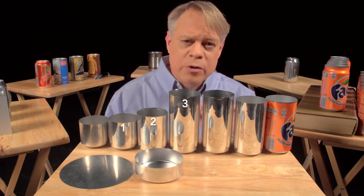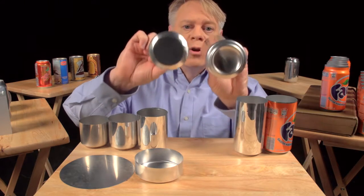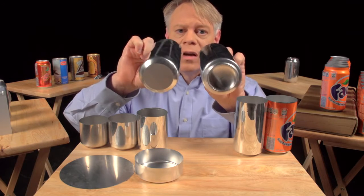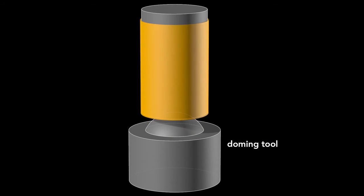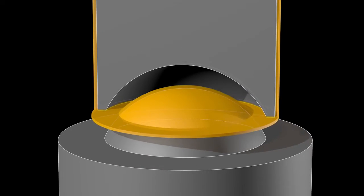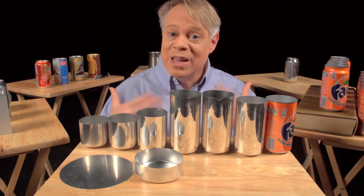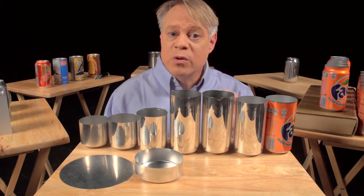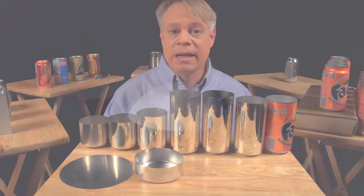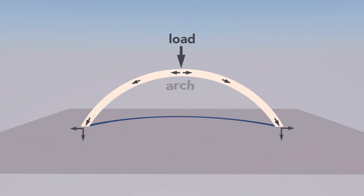If we watch this process up close, you see the initial thick wall, and then the thinner wall after it's ironed. Ironing occurs in three stages, each progressively making the walls thinner and the can taller. After the cup is ironed, the dome on the bottom is formed. This requires a convex doming tool and a punch with a matching concave indentation. As the punch presses the cup downward into the doming tool, the cup bottom deforms into a dome.